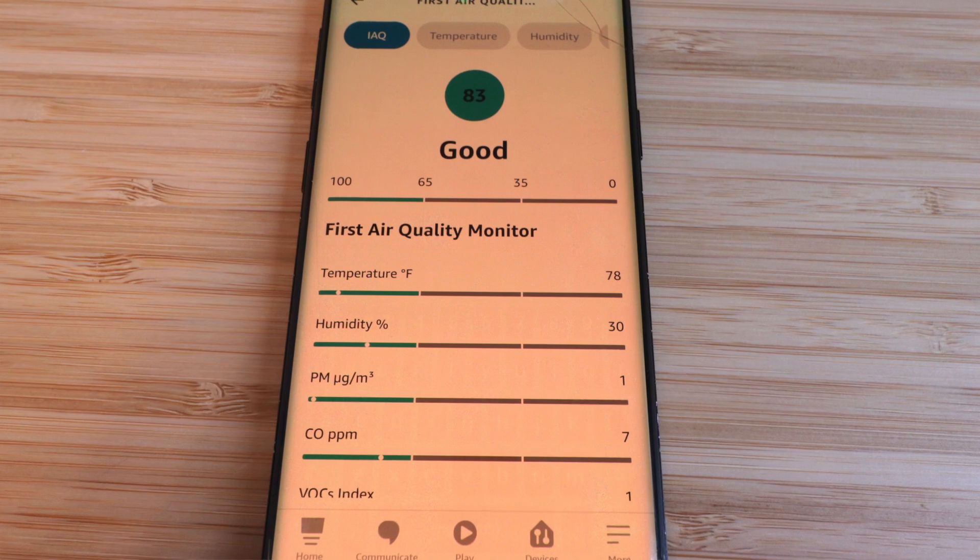The carbon monoxide monitoring was useful for making sure the older HVAC system and water heater weren't leaking back into the house. Carbon monoxide accumulates especially without ventilation in a basement. A carbon monoxide alarm goes off at dangerous levels, but you could still have unhealthy levels below that threshold — for example, if you start your car in a garage without enough air circulation or without opening the garage door.